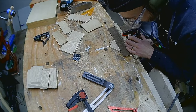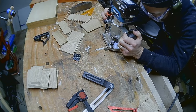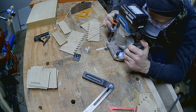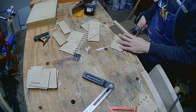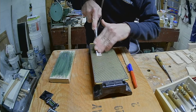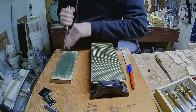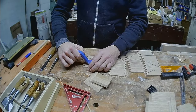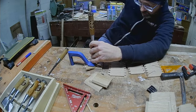The ramps are primarily held in place by dados in the walls of the tower. I made a quick jig that I can set exactly on the mark I scribed a moment ago, and then run my trim router along it to cut each dado. The router left a round end at the end of the dado, so I've sharpened a chisel to quickly square it off.